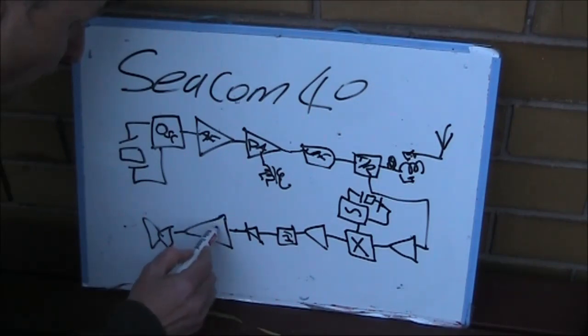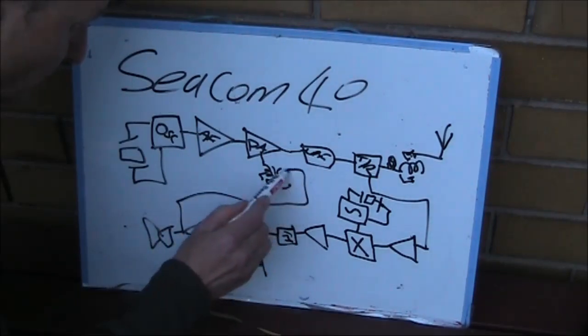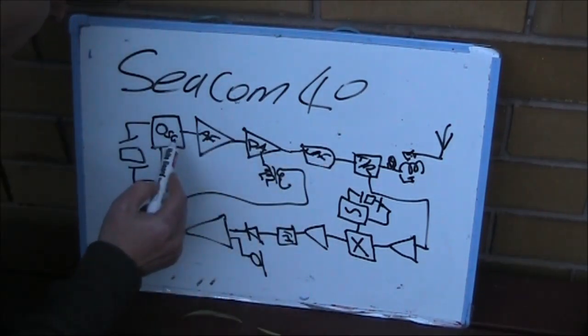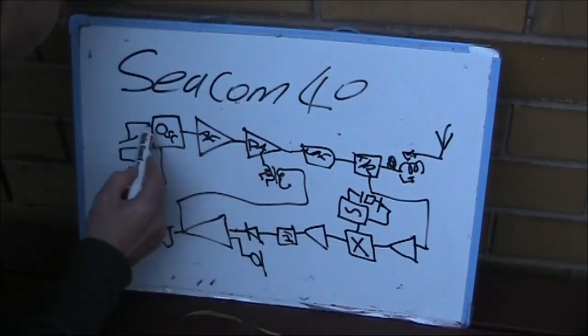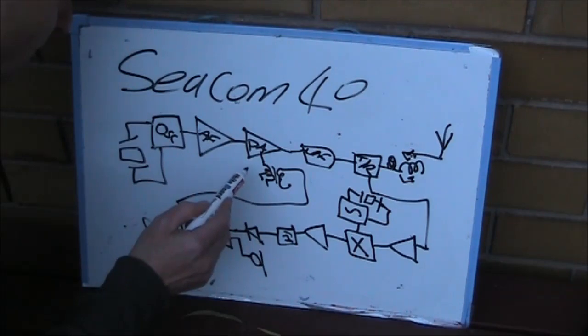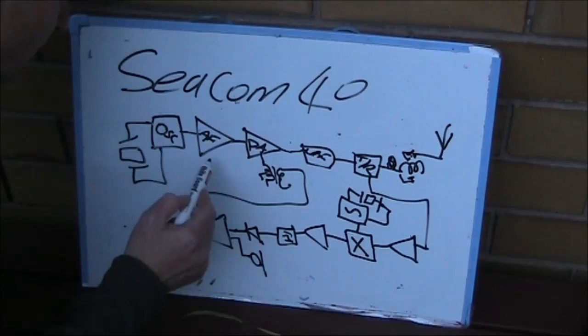To save on components, the audio amplifier is also used as the transmitter modulator. You switch it so the microphone feeds its input, and the output goes into the modulation transformer to modulate the PA, giving you AM. Something like the Seacom puts out about 10 watts, and although that seems low, especially over clear water, it can be heard strongly at 50 to 100 kilometres. It wouldn't suit an ocean-going vessel, but for something within the bay here in Melbourne, it's more than enough.